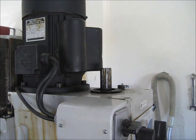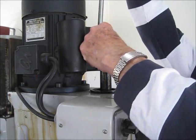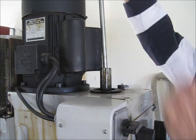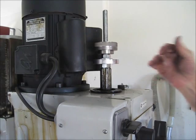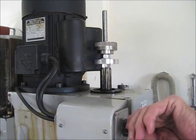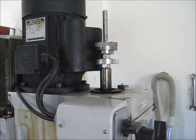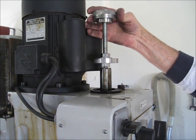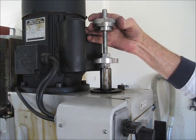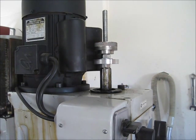The posting also pointed out that we only need to hand tighten the drawbar. So I thought: how about a new drawbar — a piece of threaded rod with a hand wheel to tighten it, and then to remove it, simply unscrew and use a slide hammer, which is just an odd piece of metal I had from the junk shop, to loosen it again.